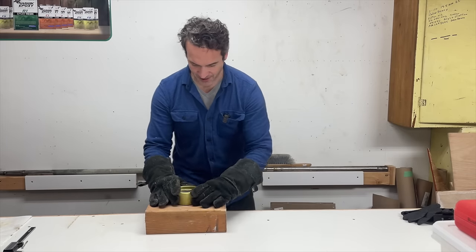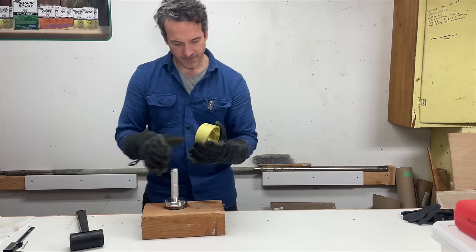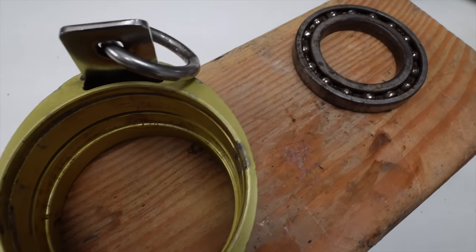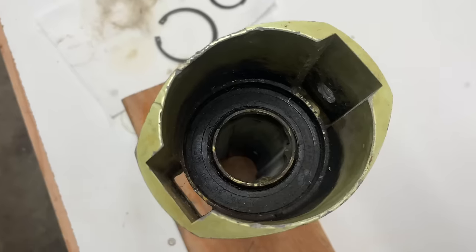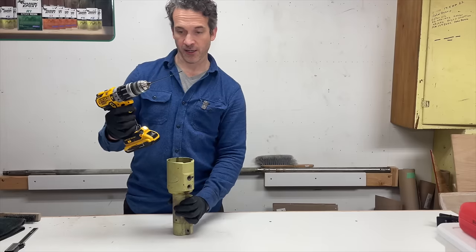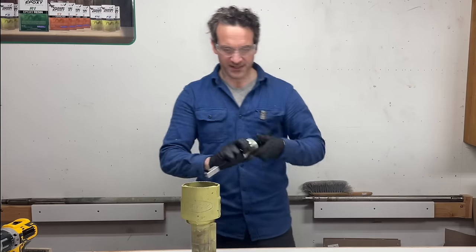We'll see if we can just knock it out here. Next we want to take a look at this lower drum unit for the staysail. This has a heavily recessed oil seal to bring out first, so this is going to be a little more of a challenge. We're going to have to use a longer drill bit than usual. We're now going to try to yank this out with the slide hammer.